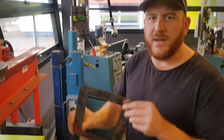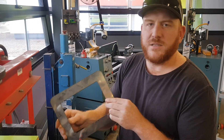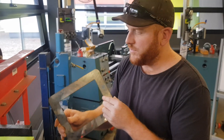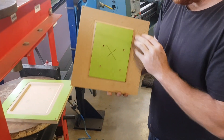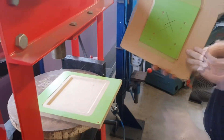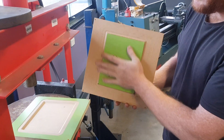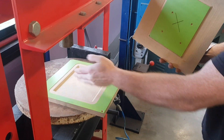Today I'm going to have a go at pressing or hydroforming this piece of 0.5mm stainless steel sheet. I've used Fusion 360 to design and machine a plug and a die or a plenum. This plug is going to force the stainless steel down into this void using the hydraulic press.